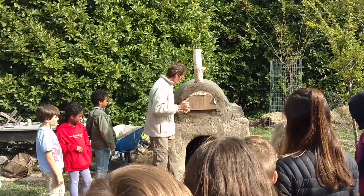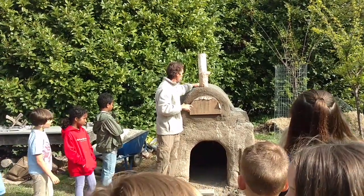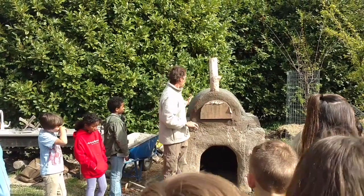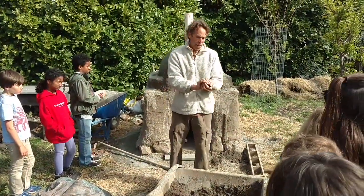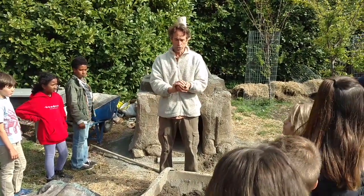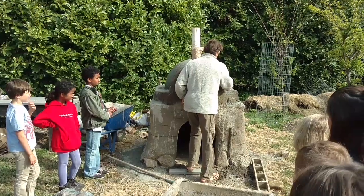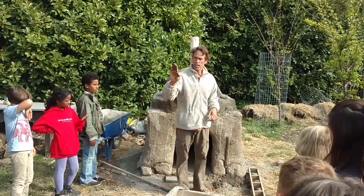And then yesterday also with the STEAM class, we worked on putting the sand mold. This is just a temporary sand mold, about 16 inches high by about 32 inches wide. We're going to be putting this cob mix over the sand mold, about 4 inches thick. What I'm going to have you all do is help with this, forming it into little cob balls, and then we'll be putting it on like this, about the width of four fingers, so it's about 4 inches thick, right?